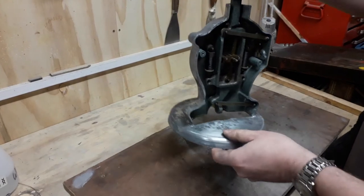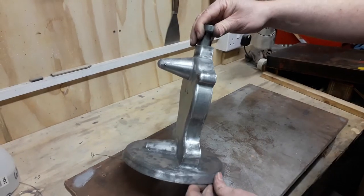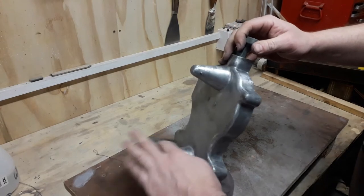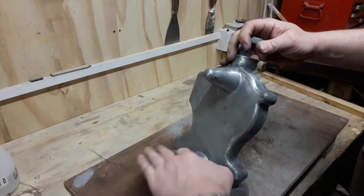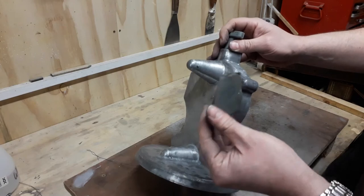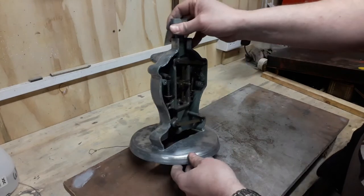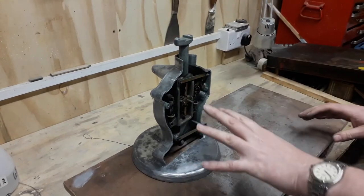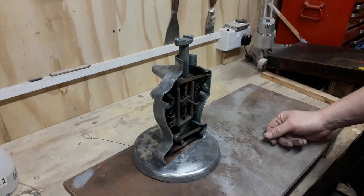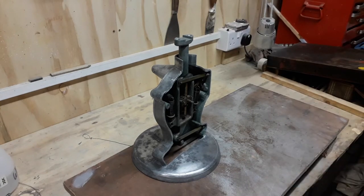They've been stripped - must admit I cheated a little bit, I volunteered my dad to do them. He's kindly stripping them for me. I used nitromors - it's a very corrosive chemical so please wear gloves and eye protection. Put it on, leave it to soak, it crinkles up and you scrape it off, then wash it off with clean cold water. Then you've just got to use some wet and dry, just rubbed all over to get a bit of a key, and then a bit of panel wipe. We've left the mechanism in - the inside just basically stops that oxidization getting everywhere. It just needs to be a usable scale to give us an idea of weight when we post things.